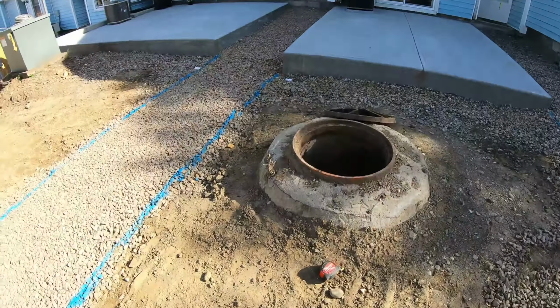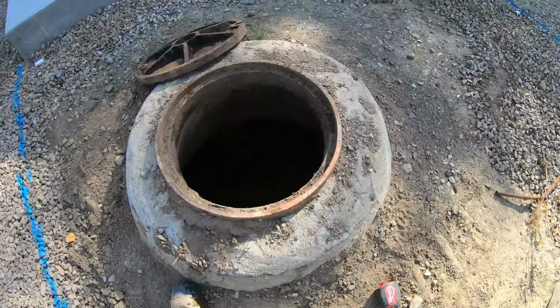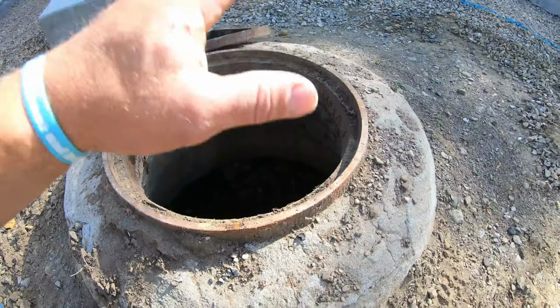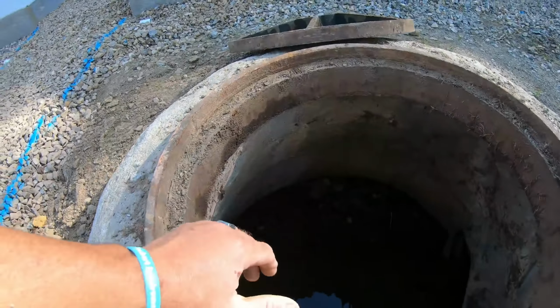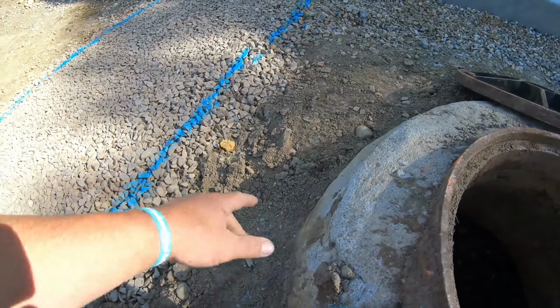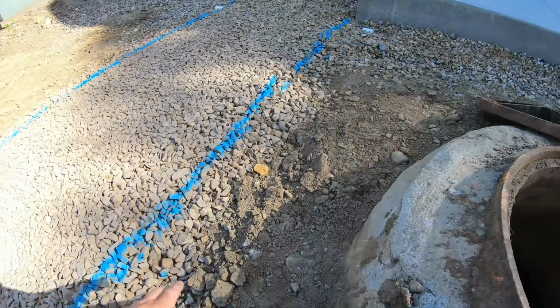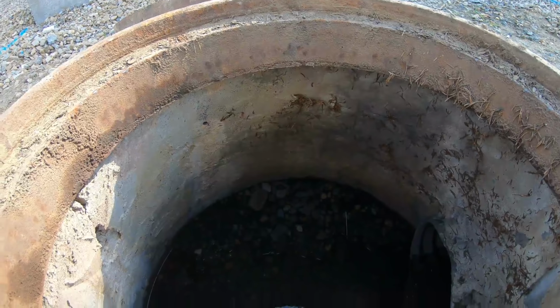But today what we're doing is we're gonna knock this down. Gonna blow out some blocks here, maybe put a 4-inch riser. So we'll take 8 inches of block out, put a 4-inch riser on here, and put this ring back on. If this ring is out to here, we might be able to get it down. Not sure, but we got to get this to our topsoil grade, which will be about here. So it's got to come down 8 inches, 8 or 10 inches.